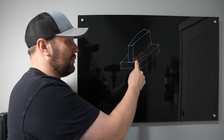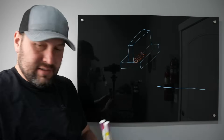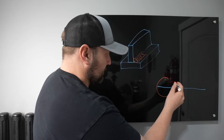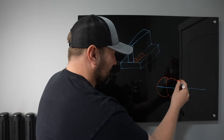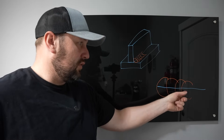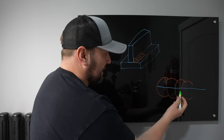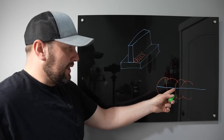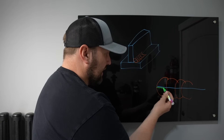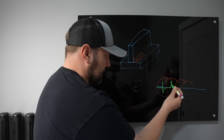This is a T-joint and we're putting a fillet weld in it. Let me show you on the board - what you're looking for are these overlapped ovals. Now the common technique is to come and do a loop like that and a loop like that, but you can miss a spot right there, so I don't really like to do that. I like to go forward and then make kind of a T-shape, and then forward into kind of a T-shape.